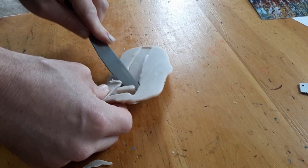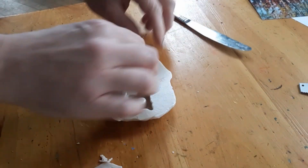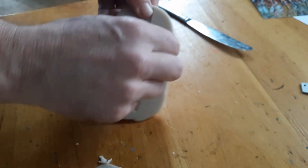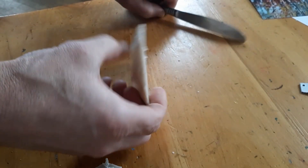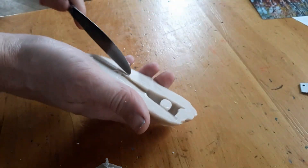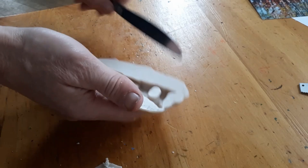Something that makes Impressive Putty different from any other mold making material is that the pieces you trim off the mold — don't throw those out. They're reusable. You can put them back in, remelt them, and make a new mold anytime you want. All these trimmed pieces are for your next mold.